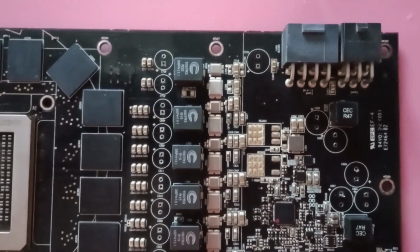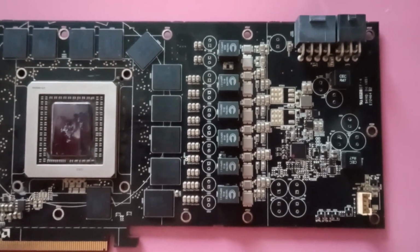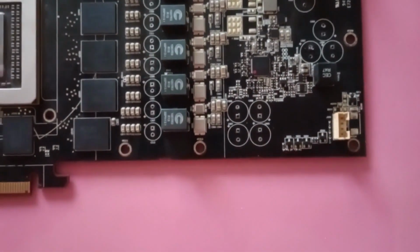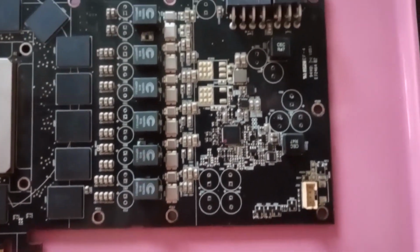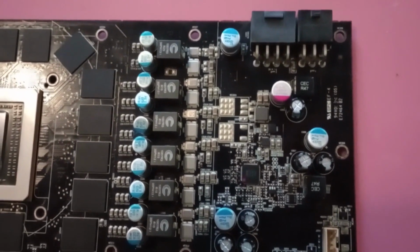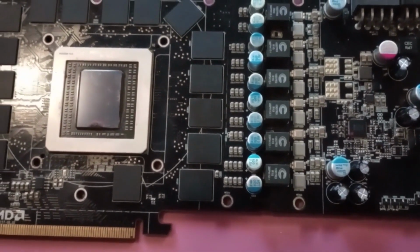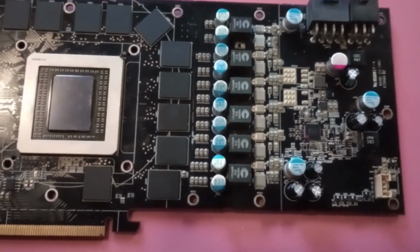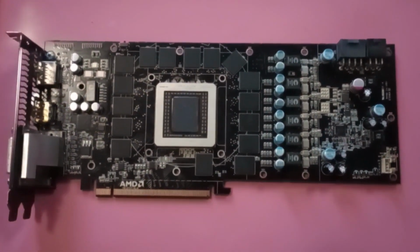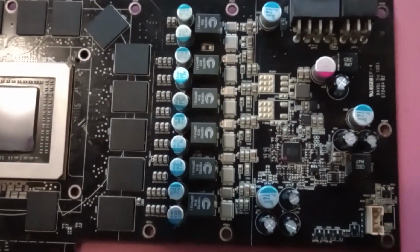I desoldered all the capacitors from the graphics card and proceeded to do the same with the 2.5 volts rated ones from the motherboard. I decided against salvaging the 16 volts ones from the motherboard, at least for now. They were too tall and they would interfere with the radial fan of the video card. So I opted to desolder instead some 16 volts caps from the dead GTX 960 I mentioned in another video, link in the description. But those were not enough. So I opted to use plain electrolytic caps for the 12 volts input, the only ones that I had at hand that would fit.